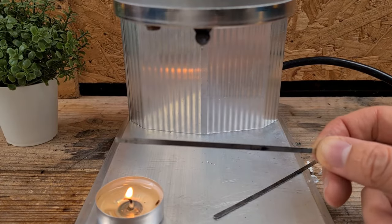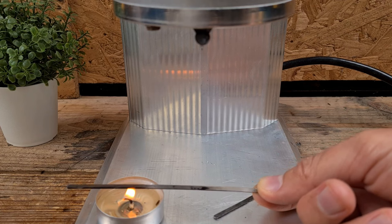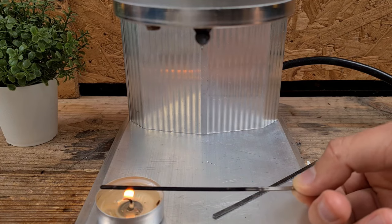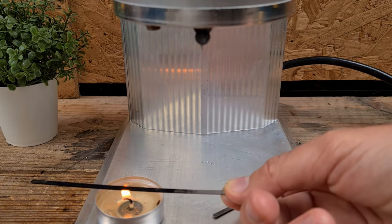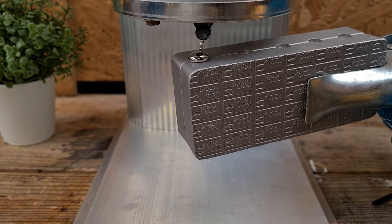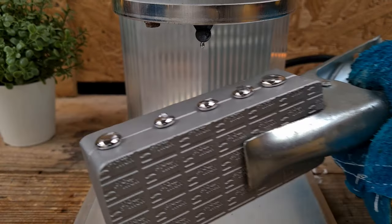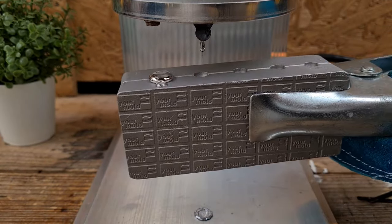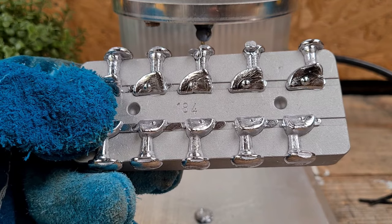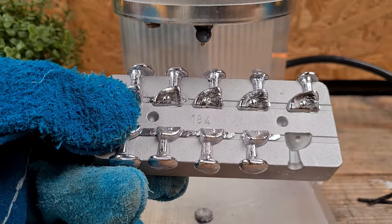This is going to go inside the mold, and we're going to blacken it with the candle soot, just so the lead weight's going to slide off it easier. Let's do a few practice pours, guys, so we'll get the mold hot. This is what we got, guys. We are going to throw it back into the lead melting pot and then pour again.